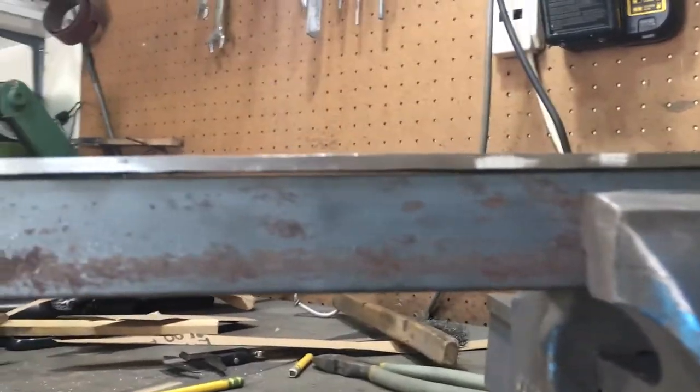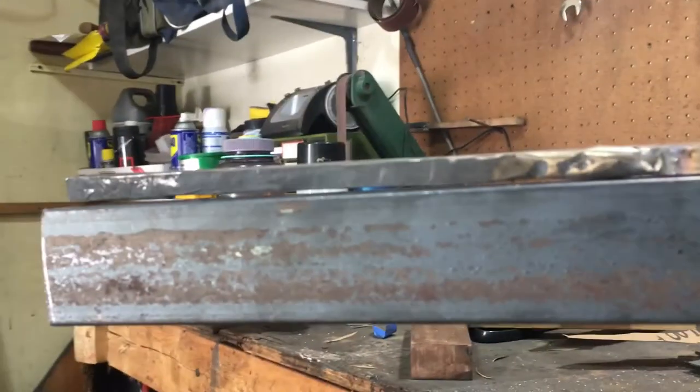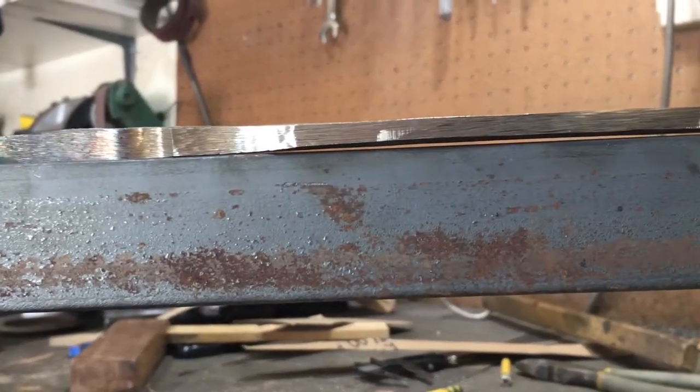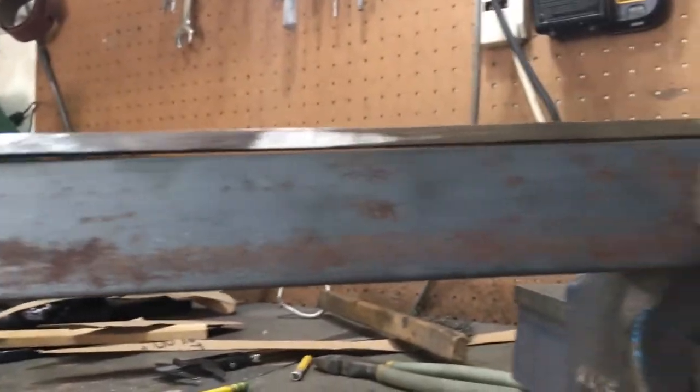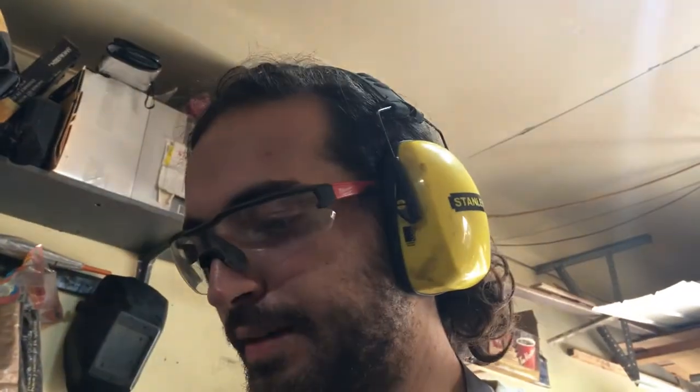All the stuff in the blade can probably be solved, but the tang definitely needs to be pulled down a little bit. I'm going to have to flatten this whole thing the best I can so I have good reference surfaces when doing everything. If worst comes to worst, I'll heat up the tang with the torch a little bit and just straighten it up.